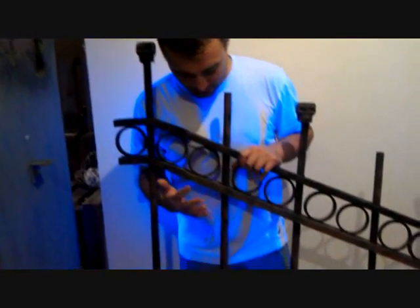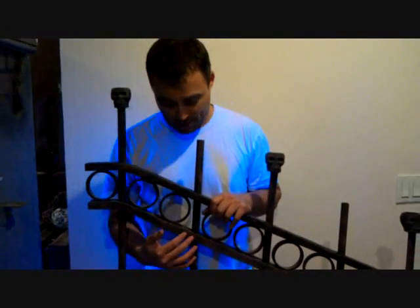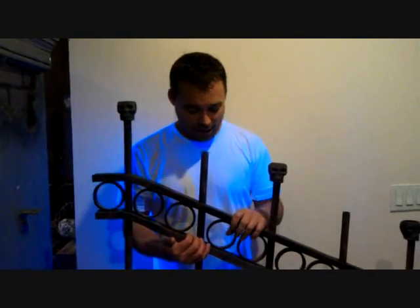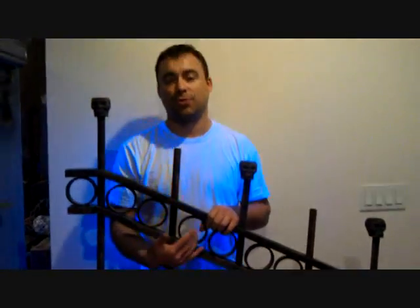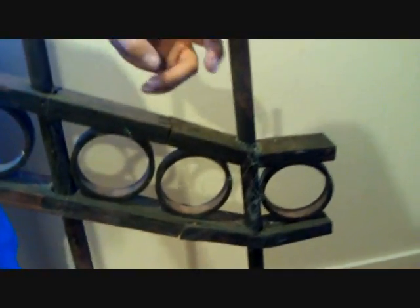Here's our fence section that connects to our large column. Like a lot of fence that you see, we used plywood instead of one-by. We drilled all our holes — you've got the half-inch PVC, the three-inch or four-inch circles. On the incline part and on the top and bottom section, I basically took the three-quarter-inch plywood and nailed it together and then cut the angle I wanted to create. That's actually flipped. Then I just used a wide-crown staple to shoot the top and bottom.